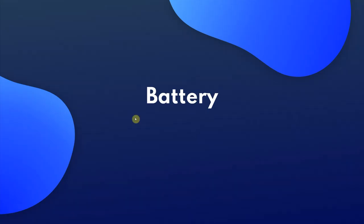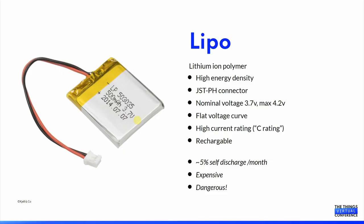The choice of a battery is very important for a project like this. LiPo batteries have become quite popular in recent years. They have a very high energy density. They often come with convenient connectors that fit many modern development boards. And they have a predictable flat voltage curve. And they are rechargeable. These types of batteries are suited for projects with high current demands, like driving motors and such. But because of a high self-discharge rate, maybe as high as 5% a month, they are not suitable for a low energy sensor.